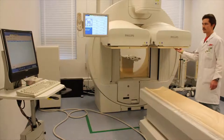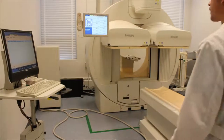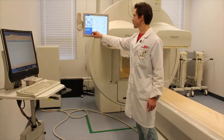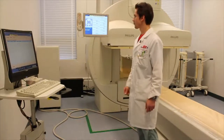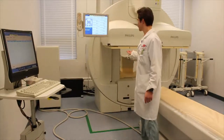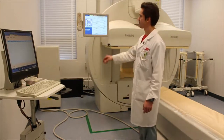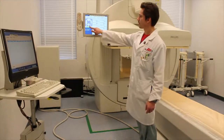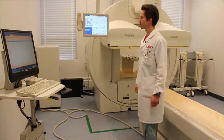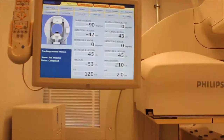Next is step one of the safety checks: the detector collision safety check. Press the safety touchpad on each detector, forcing a collision alert on the system. Note the auditory and visual response of the system on the P-scope screen. Clear the collision alert by pressing override and clearing the override function.